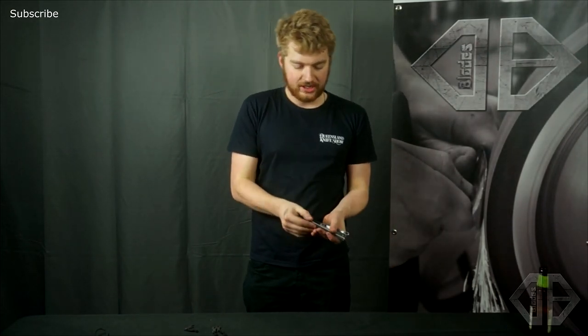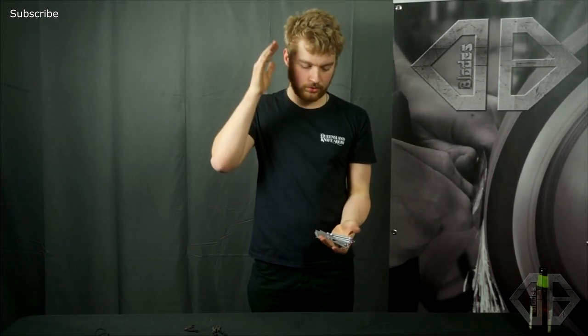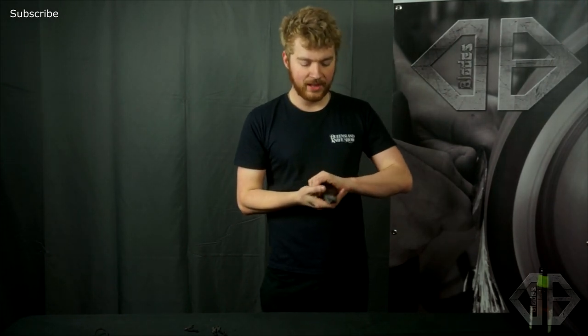Next up we've got the Surgeon knives. These are back from machining — I've got 60-odd of these things. You can see they've got that nice big lightning pocket machined in there. Probably next week or the week after I'll get these ground, sanded, then sent off for heat treat and re-ground, then off to coatings. There are 60-plus of these right now. I'm probably going to do some different colors — definitely black ones, maybe brown or OD green depending on what Elite Cerakote colors are available. The pre-order is going to come down soon since the knives will be done shortly, and they'll go back up to the original price of $136.